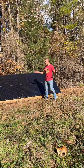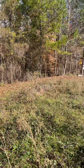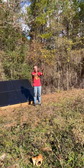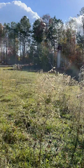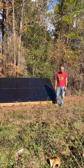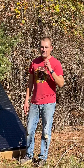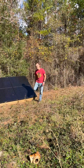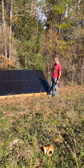All right, so here we are — we're up in our meadow. I'm facing south right now, this is due south. I did the calculations and the best direction is one degree east of south, which is basically this, so we are facing as best as we possibly can. I found a great website — I'll put it in the description — that helps you understand your tilt and direction. Our best average yearly tilt is about 31 degrees, and that's exactly how these panels are set.